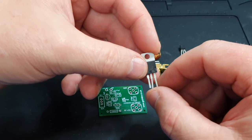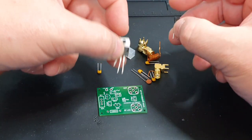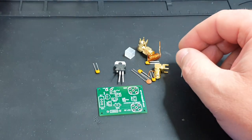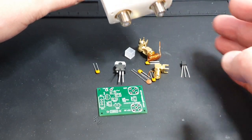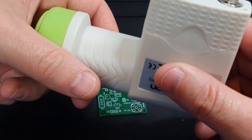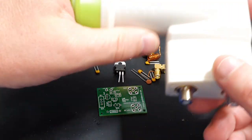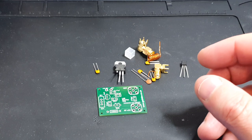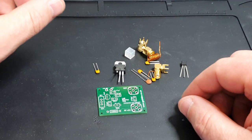This is the 18-volt regulator and this is going to give us our upper voltage. The reason you want two voltages is one will control the vertical alignment of the LNB, and when you switch it over to 18 volts it will go vertical - or vice versa, depending on how you've got it turned in the dish. You only need a small TV dish or something like that to really get going - it doesn't need to be complicated at all.